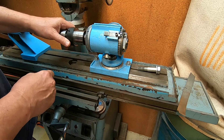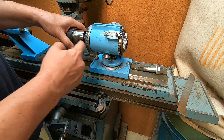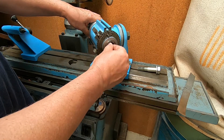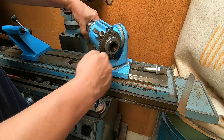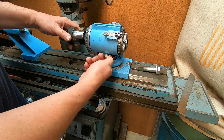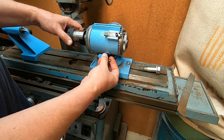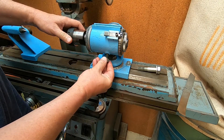This particular version has a four Morse taper bore through the middle of the spindle and a larger hole on the back. I've seen some people fit a spindexer-type thing clamped in there and wind a handle to get controlled rotational movement, which should be useful in some situations. There's also a locking screw for the rotation, and it has a brass insert on the end so it doesn't score up the rotating shaft.